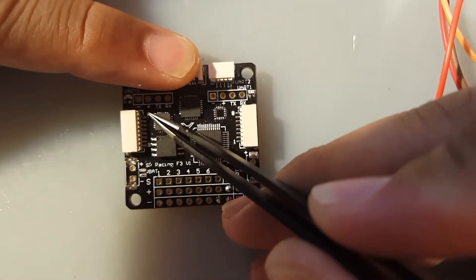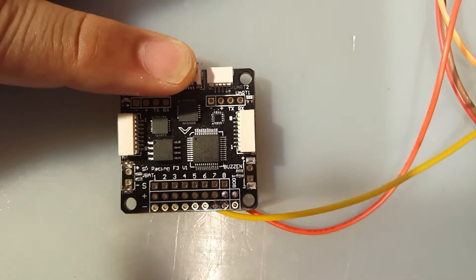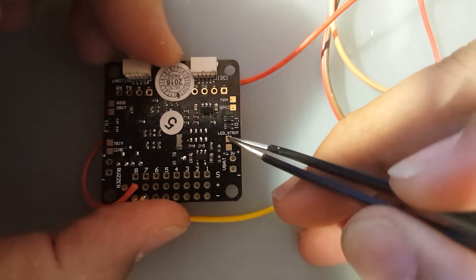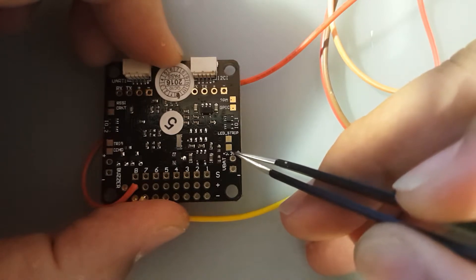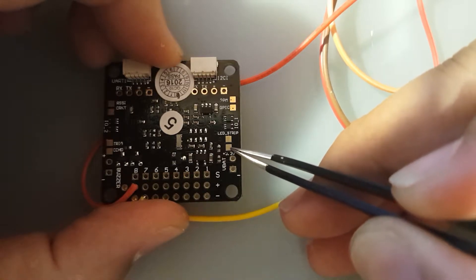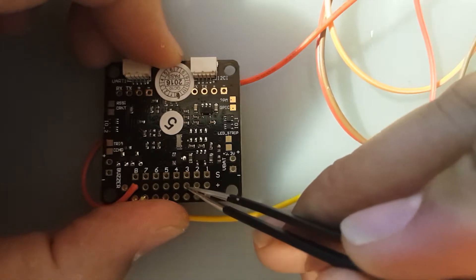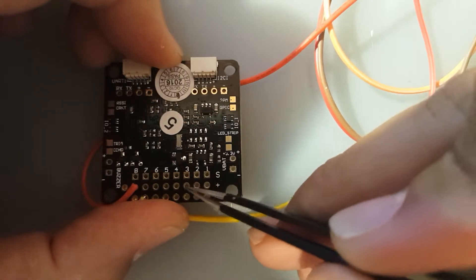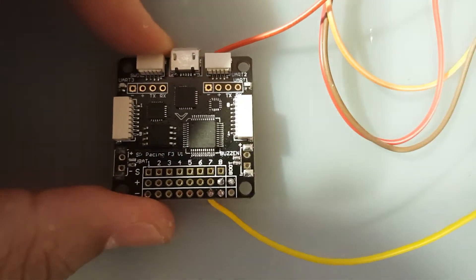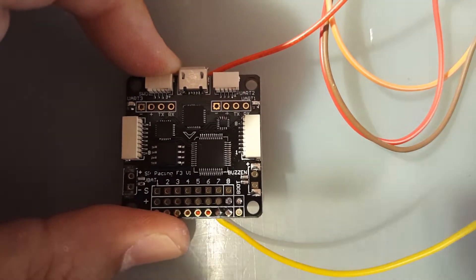There's one and then there's eight, so it's counting down this way, meaning seven would be right here. There's another port on the back side - it's actually a pad right there, next to a 3.3 volt pad. Common sense might say just power from there, but that's not a great idea because these LEDs take five volts. We're going to be powering the LEDs from the power rails right there. You can either solder it or use a connector - we'll use a connector in this tutorial.